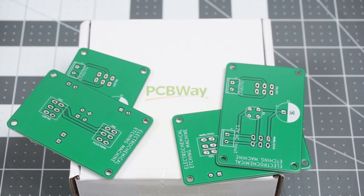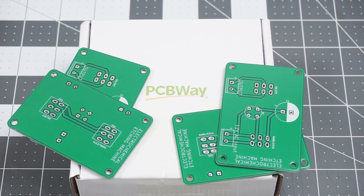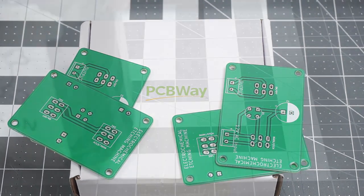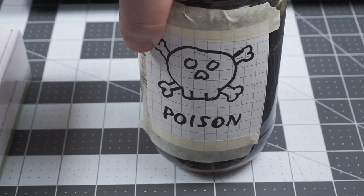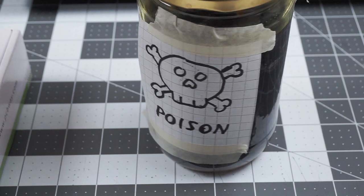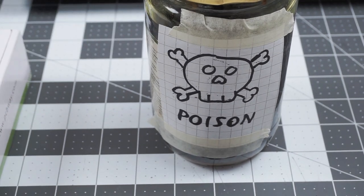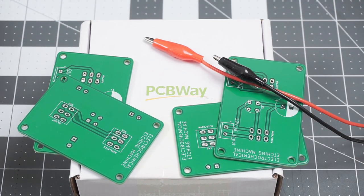For more complex patterns, there's chemical etching. Basically, you create a mask, masking out areas where you don't want to etch, and then use an acid to do the actual etching. The drawback is, you need to use chemicals that require special caution while using, storing, and disposing of them. Some people don't like having such chemicals in their workshop. The answer is electrochemical etching. Etching using electricity and a conductive electrolyte solution.